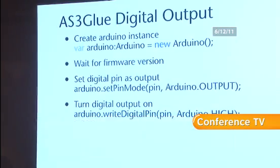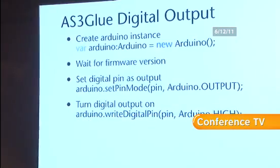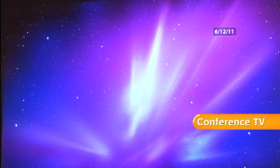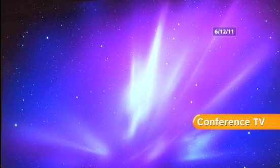Okay, I'm going to do some analog inputs next. So we don't need that anymore. Now, I'm going to plug another Arduino board in here, and this Arduino board has another shield on it. Because I'm using another Arduino board, I've got to change the serproxy setup here, and it has to use a different serial port. But luckily I know what it is, and I'll just do that. Shut this one down, and run it up again.